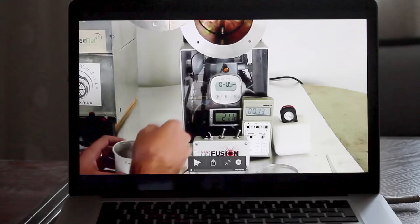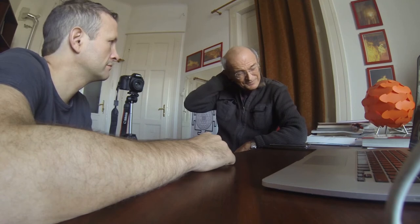Pestle and mortar. Did you use maybe a metallurgist's microscope to define the grain size? Well, actually, later on, we had access to a very high quality microscope, but before that we used a simple, inexpensive, so-called digital microscope, which is able to magnify only 20 times optically and another 20 times digitally. So we were able to use these kinds of digital microscopes in the early days. We even had the records.